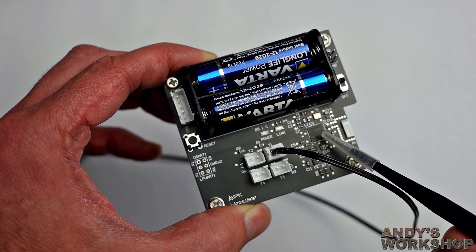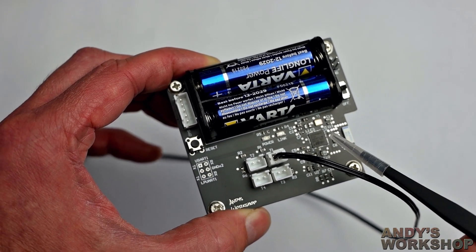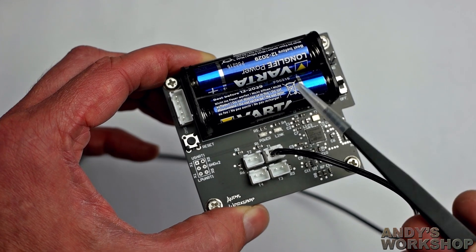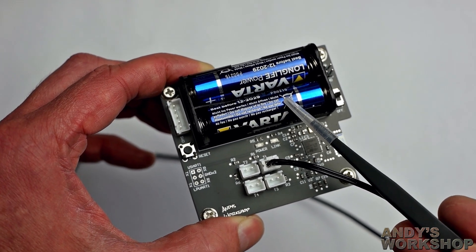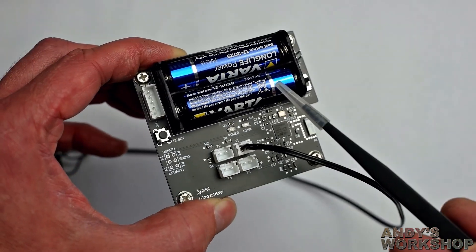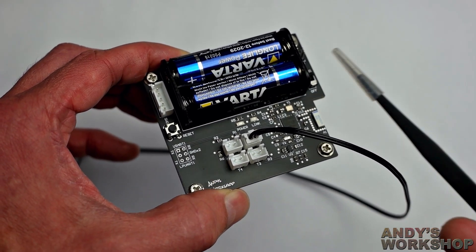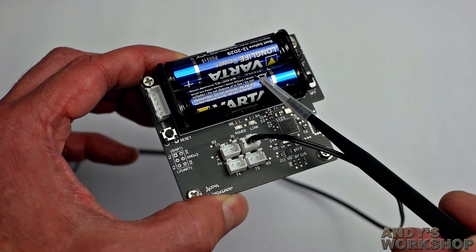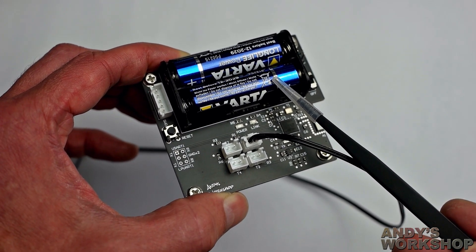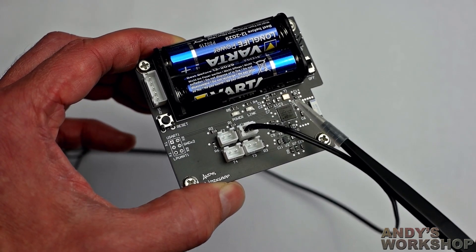So we've got the WB55 there. It requires an oscillator and just to get this board into something demonstrable, something I could play with, I decided to make it battery powered so I can move it around. If you're going to be wireless, then one of the likely parameters for your project is that you're going to have to move it around to different spaces where power might not be available. So I decided to build in battery power. We've got two AAs there and I'm not running this through a regulator to preserve battery life — those batteries are going straight to the STM32 WB55 to power it.